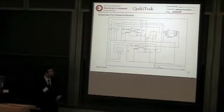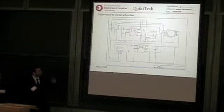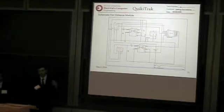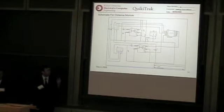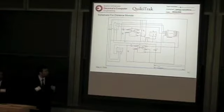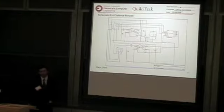So as you see, it has 2 pins going to an inverter. The reason for the inverter is that we are using an optical coupler, but it's an inverting optical coupler, so we need an inverter to invert that signal again in order to restore the proper polarity. And the reason for the optical coupler is because we have 2 power sources.